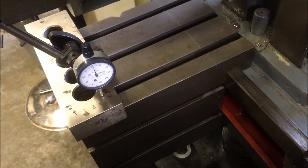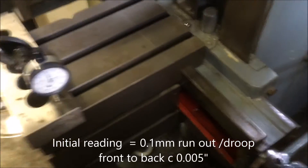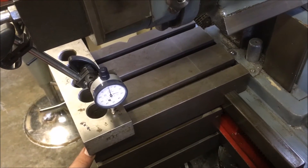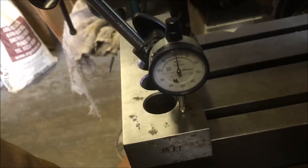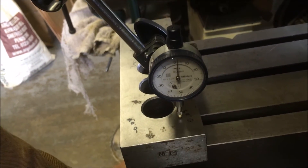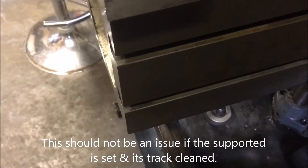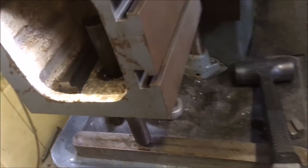When I first started I'd got 0.1 mil from the indicator at that point to the front of the table, which is about 5 thou. I couldn't work out how I'd managed to achieve that. What I have found though is that lifting the table a bit shows all the play there. So getting the vertical support underneath the table dropped down and clamped up makes a big difference.